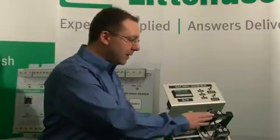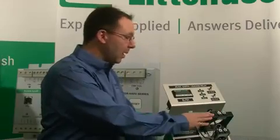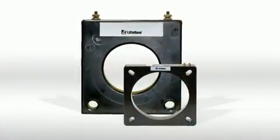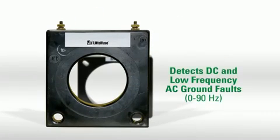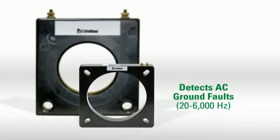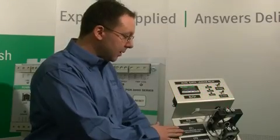The EL731 is designed for use with an EFCT series current transformer. It comes in three different sizes — two sizes are shown here — and they can be connected to the earth leakage relay to sense low frequency to DC ground fault or higher frequency ground fault. Only one is needed if you're only interested in a certain range.